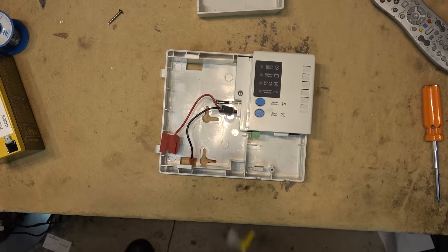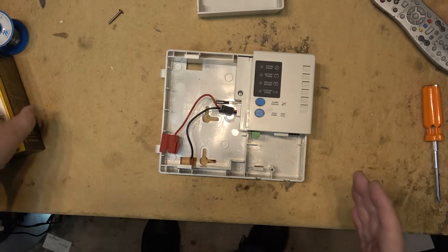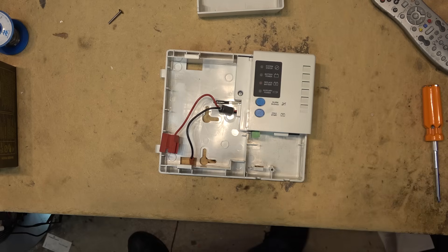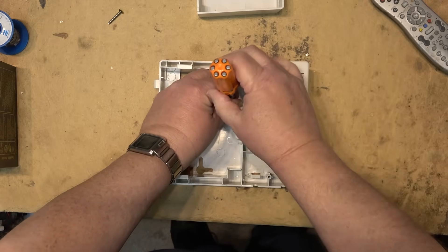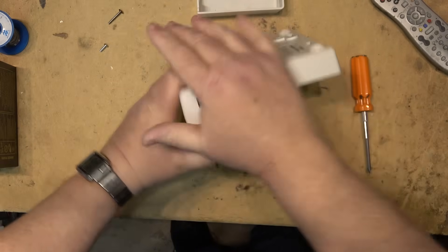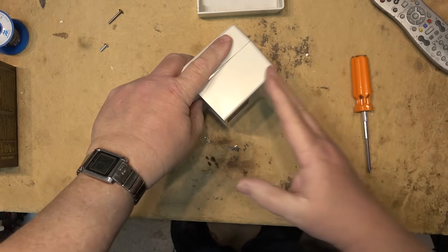I want a Wi-Fi backup because the problem is that cell phones do not work when the power is out. All the micro cells close enough for my phone to connect to are powered off the grid, so if the grid is down, all the micro cells in the neighborhood are down as well. There's no cellular coverage — I have to go outside, hold my phone up over my head, and hope I can reach one of the battery-backed or generator-backed sites. In my case it's a generator-backed site at the central office, but it's quite a ways away from where I live.